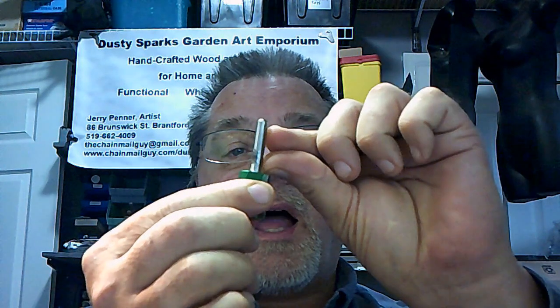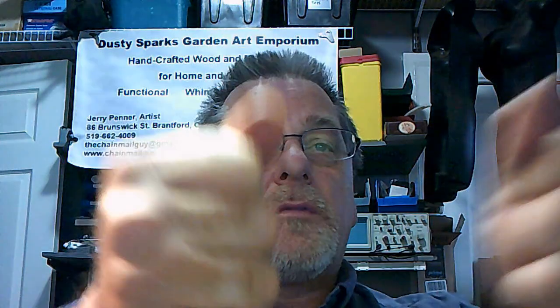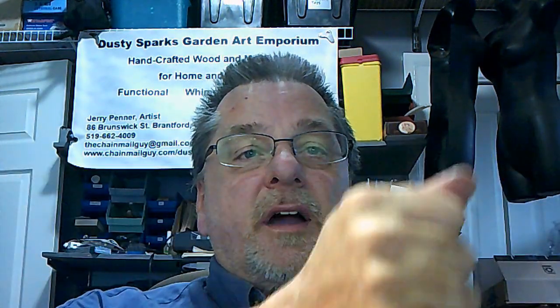Now before the bit breaks, it'll start to wiggle out of the chuck. You won't notice as you move back and forth, moving from one side to the other. But when you move from side to side, to clear off any high spots you'll miss, then you'll find that the bit may be cutting deeper on the starting side than on the finishing side.